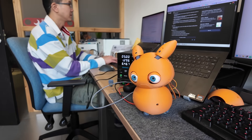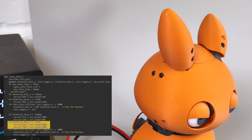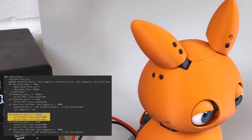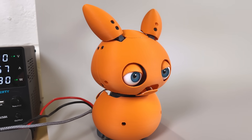The final part of building the personality is posing and animation. At this stage I had in mind that the robot would perform a few pretty basic tasks: being idle, listening and talking. This is definitely something I'll revisit as the project progresses, so for now I made the animations with simple loops — for example the ears are moving towards a particular target until the timer reaches zero, then the target switches to the opposite direction. But I programmed these animations essentially as states, so I can command the robot to be in the idle state, then command it to be in the talking state and it will keep jabbering away even though the loop is still repeating and it's still listening out for new commands.